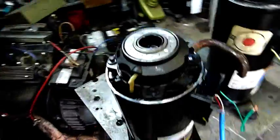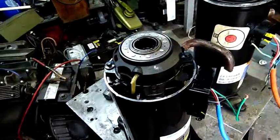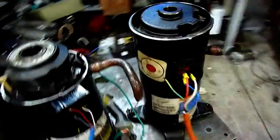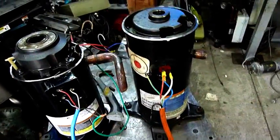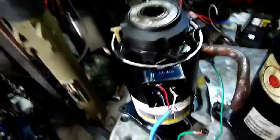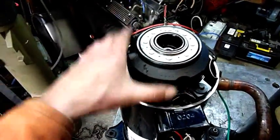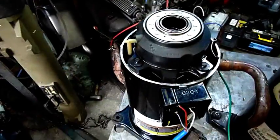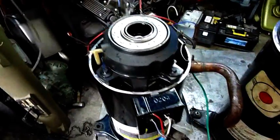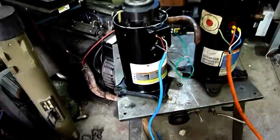For reciprocating compressors, it's always Danfoss — I'm not sponsored by Danfoss, I just prefer their reciprocating compressors for domestic and commercial stuff. But these are a good compressor. Scroll Technologies makes a good compressor. Copeland seemed to be the biggest name in the industry — they have a digital modulated scroll that moves this up and down through an electrical signal. There are a few different scroll models coming out: electronically controlled, variable speed scrolls.